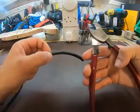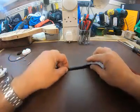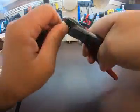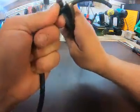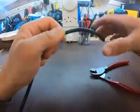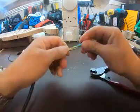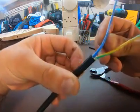You now have to strip the wire. I'm going to use my cutters — you can use a knife if you want, score along gently — but I'm going to use my cutters. I'm going to score it very carefully, making sure that I don't damage the actual wires inside. I take my time with it, there's no need to rush. Once scored enough I can break it away, just like that, freeing the cores. You can see I've not damaged any of them.